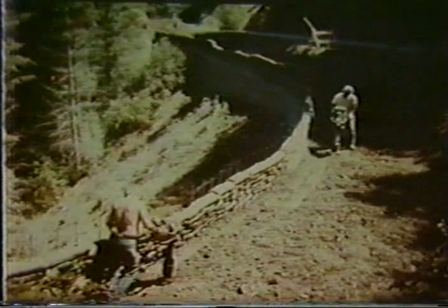This is what one of these systems looks like in construction. What you see here are the bags of concrete. You also notice that there's the rebar that has been driven through, or the bags of concrete have been speared over this rebar. And it's backfilled, and of course, since it's a fairly lightweight system, you don't want to use very heavy equipment right against the front face.